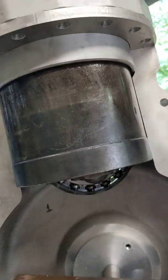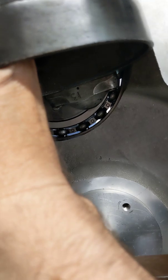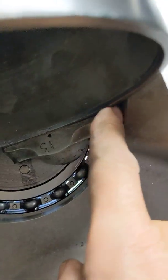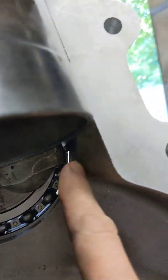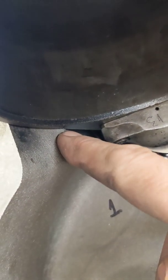It's quite an important thing, and the reason to do this now rather than wait for final assembly is so we can check for clearance. You can see we don't quite have clearance at that point there — this part of the sleeve is just contacting this part of the engine case, and it's the same on the other side as well. Just contacting there.